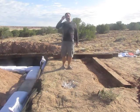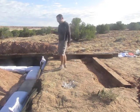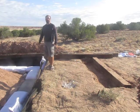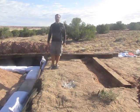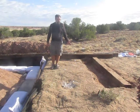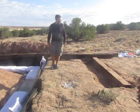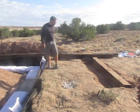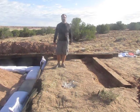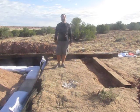That catches you up to where I'm at right now, and where I'm at is a change of plans. Originally I intended for the door to be right here at ground level and then you walk down a few steps into the building, but those steps are going to take up way too much floor space in an already small building. So I moved them to the outside — that requires some additional excavating, but it has to happen. I've staked out roughly where the steps are going and I've put in the first one. I'll do a time-lapse so you can see that in process.